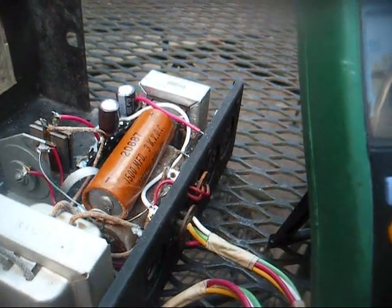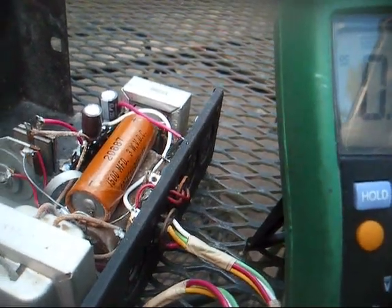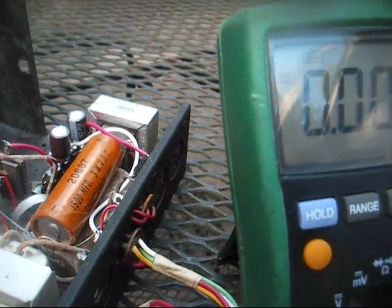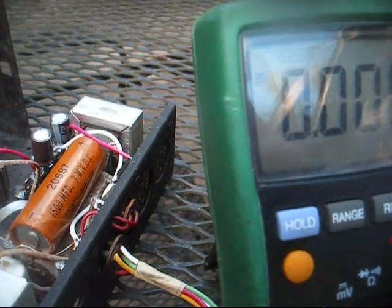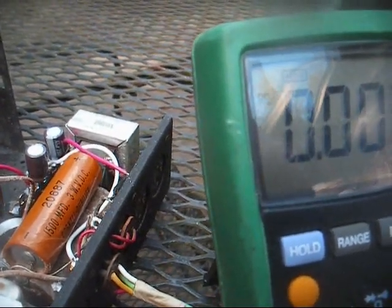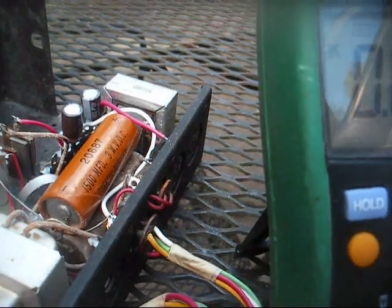Okay, I'm running 1.3 volts, which will probably go up a little bit whenever I change those filter caps in the filament line. Now that's about as low as I'd want to run the filament voltage, because sometimes, especially the oscillator and mixer tube, once that filament voltage drops below about 1.3, 1.2, it will stop oscillating. The rest of the stages in the radio will work, but that 1A7 tube just won't have enough emission at that point to oscillate, especially if it's a used tube. It's got a lot of hours on it.